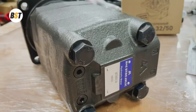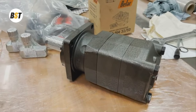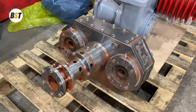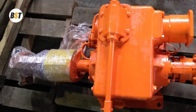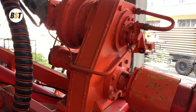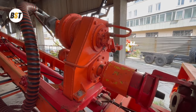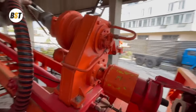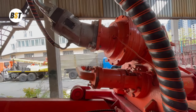We can supply, for example, a drilling rig with a hydraulic motor MT-500 with a torque of 1,320 Newton meters, or an RG2 hydraulic reducer with 2,000 Newton meters, or a 2A rotary head also with 2,000 Newton meters, or 2D3 rotary heads mostly used on truck-mounted URB models providing 4,000 Newton meters of torque. It is also possible to reach up to 9,000 Newton meters with the help of a G-rotor type rotary head.